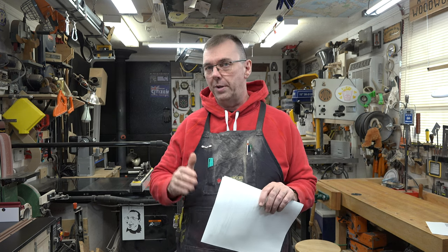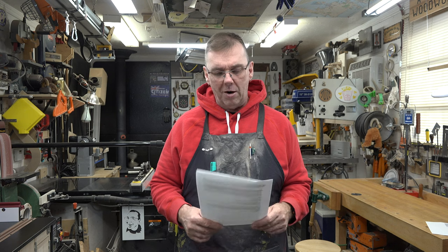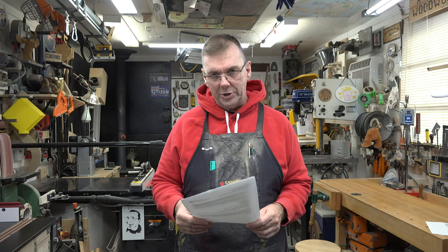Okay, so the bottom line here is that the dado your blade is supposed to go through is not cut deep enough for the back end blade guard. So what's the update? Guys, if you are doing finger joints in 3/4 inch material, chances are, unless Incra has changed or modified their design, you are going to be cutting into your blade guard. So don't let that shock you.